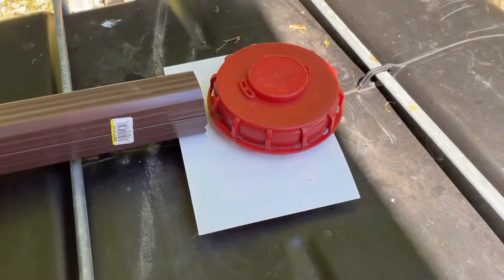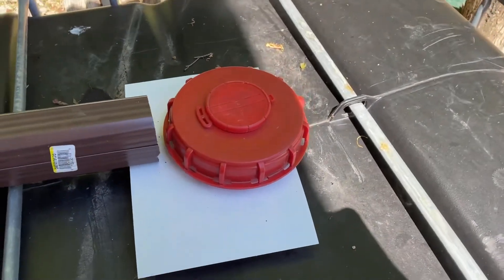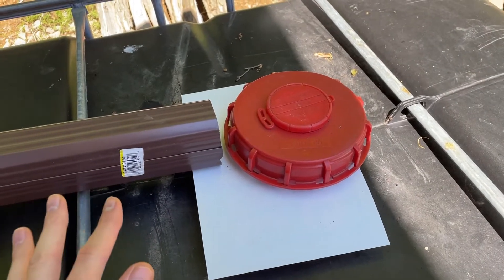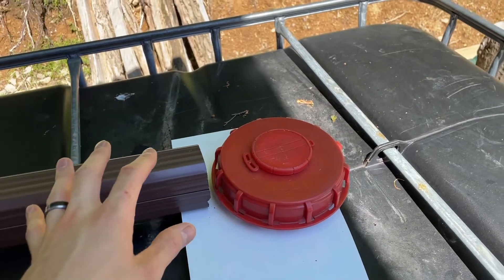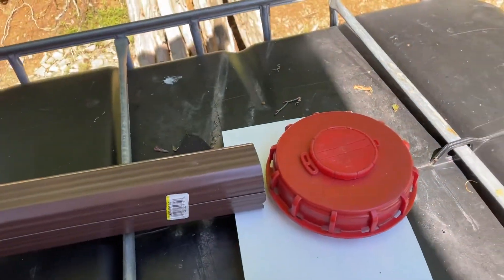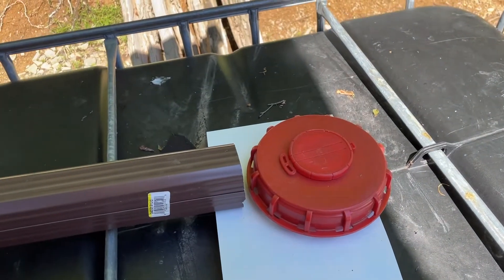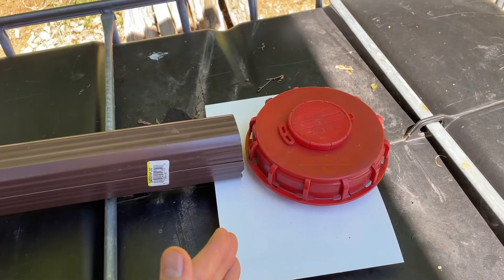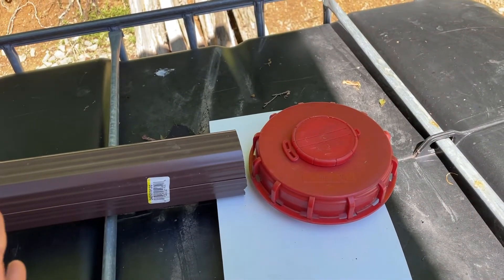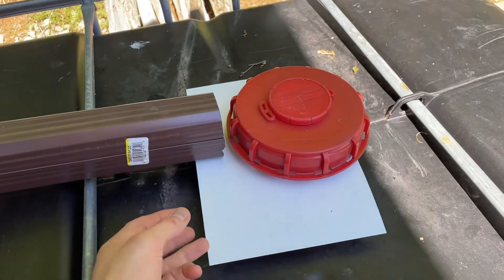To keep the water clean, this is just a piece of plastic — like a plastic sign I found in the basement. Some people have fancy clean-out systems. The concept is that water coming off your roof — whether it's a barn or whatever — carries bird poop and nasty stuff. It's like a dirty dish: you want the roof washed before you start collecting water. Let the rain run for a bit like a big washing machine, and don't let that first dirty water go into your tank.